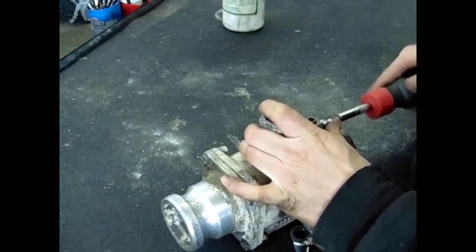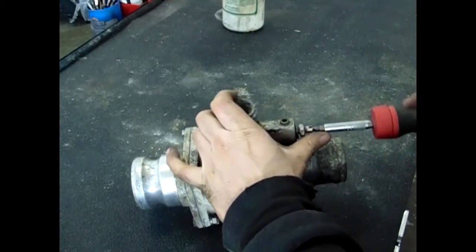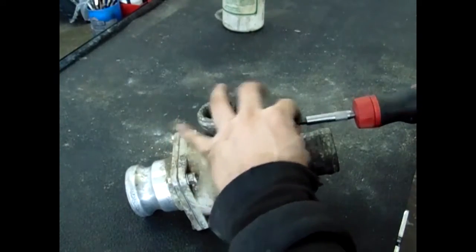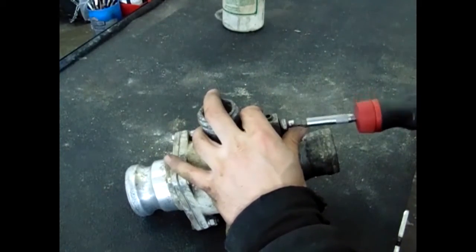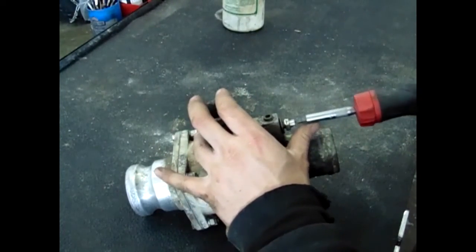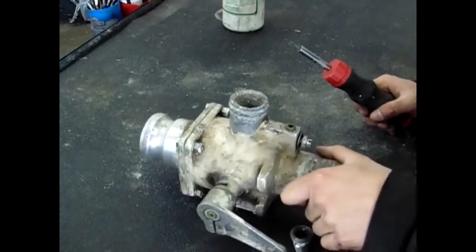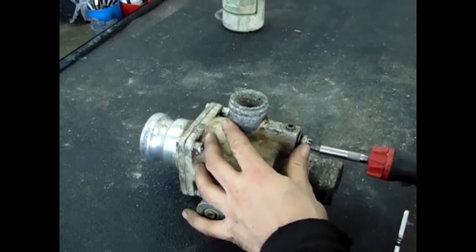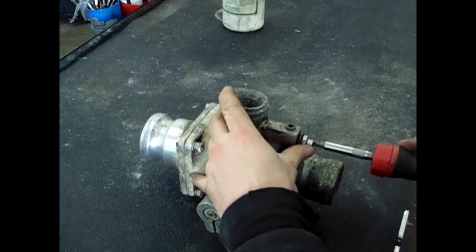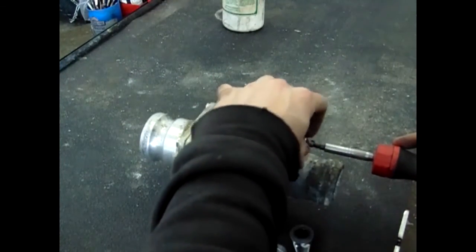Your suck back may have been set out more to compensate for a valve that is having some bypass or leaking issues. Remember, as you're overhauling the spray valve, there are two ports in the spray valve system: one directly in line with the adjusting screw, and one just inside the threaded part of the valve that goes 90 degrees and enters into the boom side of the spray valve. If you look at the cutaway drawing on display, you'll easily see what I mean by the 90-degree port.